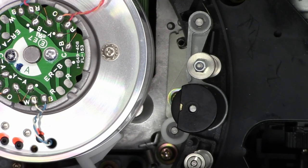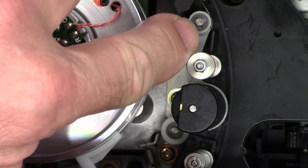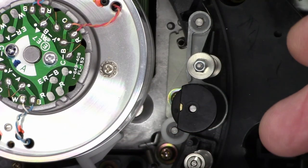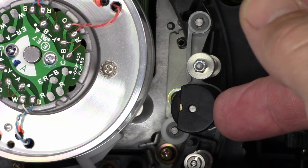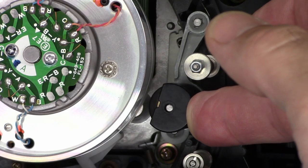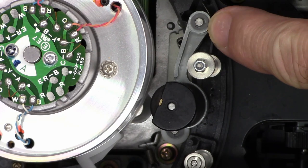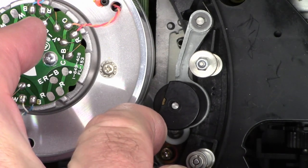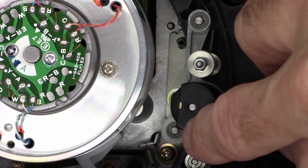So I have the loading ring partially threaded. This is the pinch roller right here, and this is the pinch roller loading arm. There's a solenoid on the other side that presses on the back of this on the top and bottom to engage it. I've let go of it and it's slowly moving back. What has happened is the grease in here has gone dry and is acting like a glue. There actually is a spring underneath that's supposed to keep this in the retracted position — that's why it's having trouble loading.